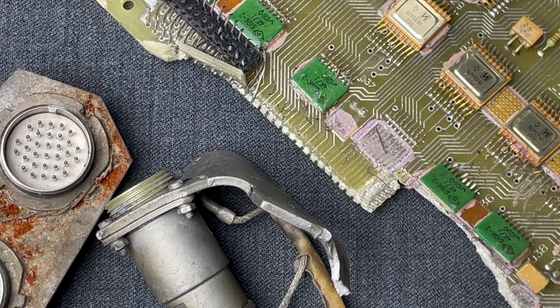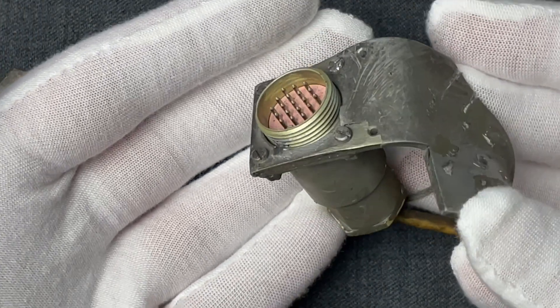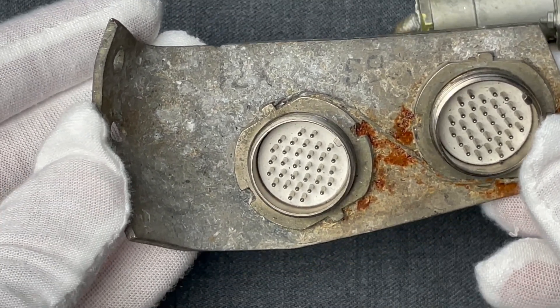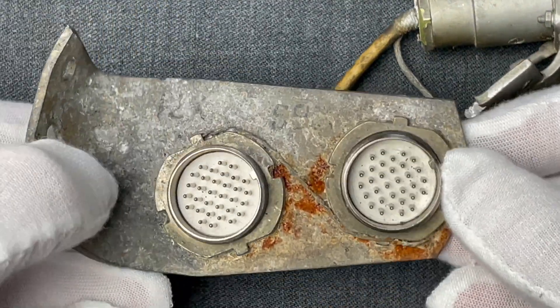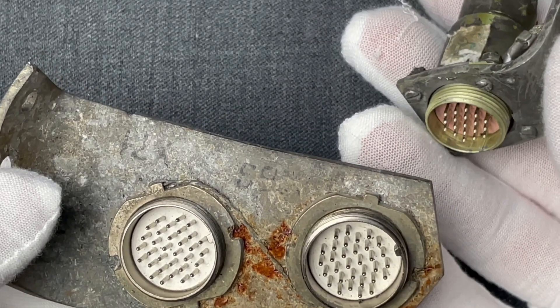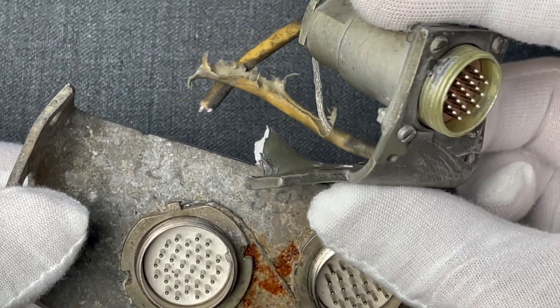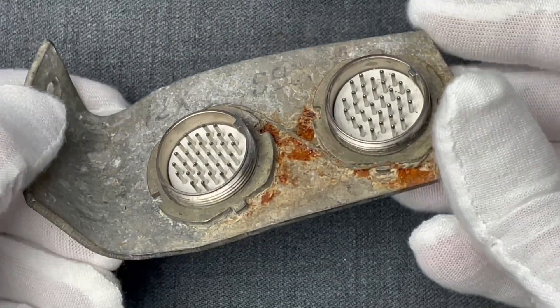After the collection, we go to the second phase: exploitation and analysis. Here is where experts in the different materials will analyze and document them in detail. For instance, this one is from a lightweight aluminum body with a coating, while this one is from a heavier alloy. They'll record the type of connectors being used, the number of pins, how the grounding is implemented, the size of the bolts and threads and sockets, the part numbers, and the various techniques used — such as this locking wire.